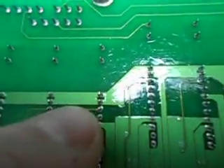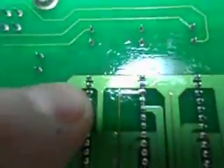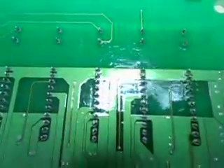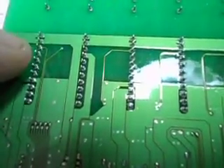So it would be relatively easy to solder wires onto here, but you wouldn't have the benefit of the additional filtering just prior to the input to the ADC. So that may be the ideal place to attach the connection — it's the third pin down here in this group.